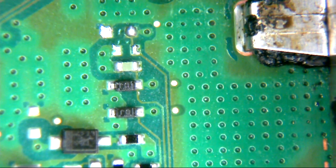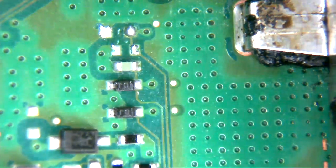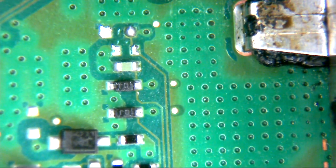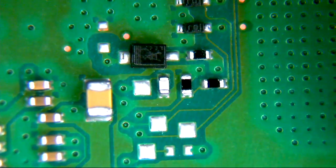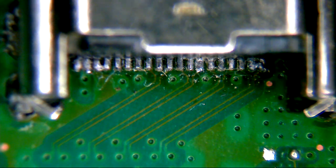So what have we got to do? Well, not only is it missing that protection diode, it's also missing that little 2K resistor as well. Without that, you're getting no picture regardless of how well your HDMI port is soldered onto it. We are going to have to drop this port off, replace that little protection diode, and re-solder that 2K resistor.